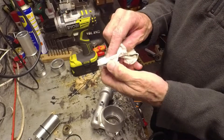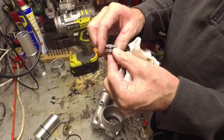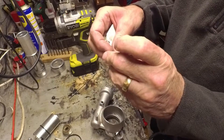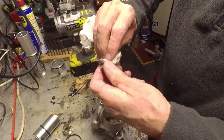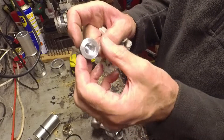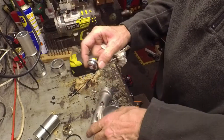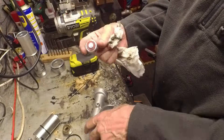I've managed to get it out finally. So here's the piston with its O-ring seal. Wondering why it's got this washer on it — is that some kind of valve? Can't be — that's sort of solid that side, so there's no passageway through. So I guess that must just be a buffer for hitting the end of the cylinder. Yeah, that'll work.